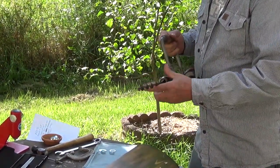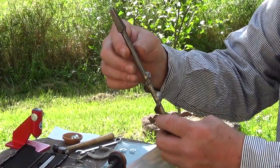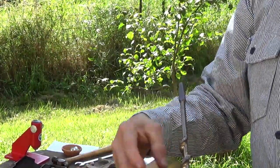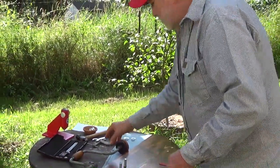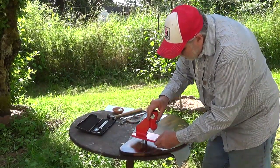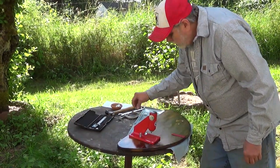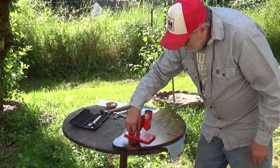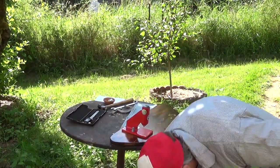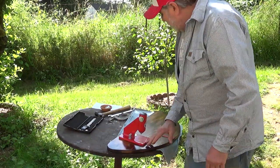The bits are interesting — the top is a pyramid shape, and the jaws have a groove in them. They pinch here and also lock here so it can't move at all — it's solid, so you cut a perfectly straight hole every time. Really great old tools. I'll mount this on here, and once I put the nuts and washers on and tighten it up, it'll pull the heads down further into the wood so they're flush.